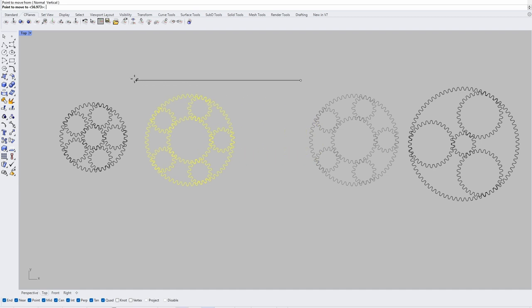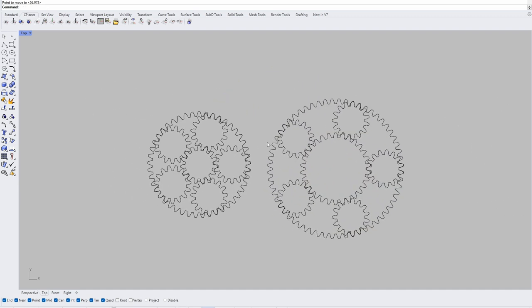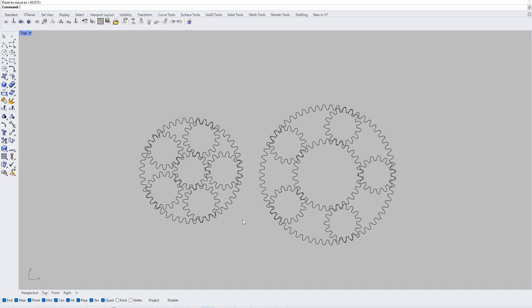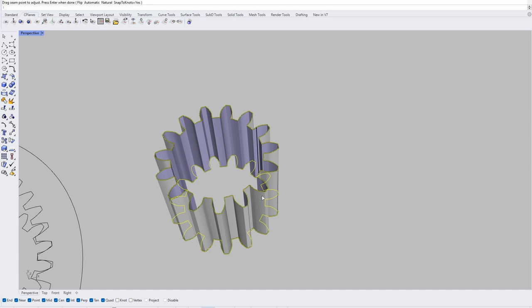These look like my two reasonably sized options that will work to 3D print. Keep in mind that because this is being printed on an FDM printer I don't want to make the teeth too small, so I don't want extremely large tooth counts. The configuration with the closest spacing between the planetary gears themselves is the one I'll be going with.